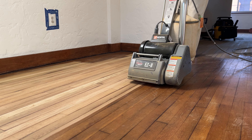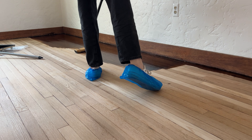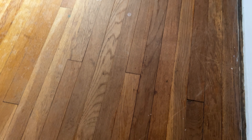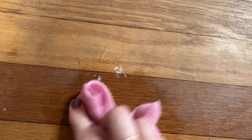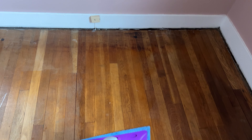The first project we did in our new home was refinish our hardwood floors on our first floor — we have two videos on that process if you're interested, I'll link those below. We eventually planned to do the upstairs, but I was noticing how rough the floors were in our guest bedroom so I wanted to do something to help them hold up in the meantime. I started by giving the floors a good cleaning, just scraping off some of the paint, vacuuming, and then applying Rejuvenate's floor cleaner using their spray mop. After that I applied Rejuvenate's floor restore.